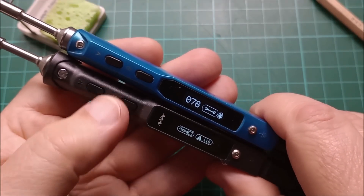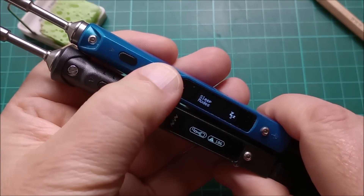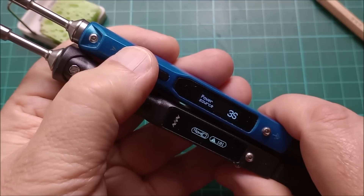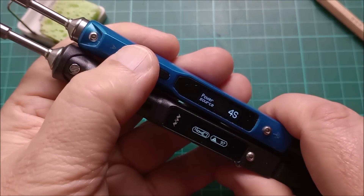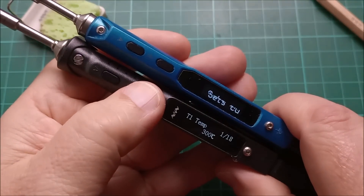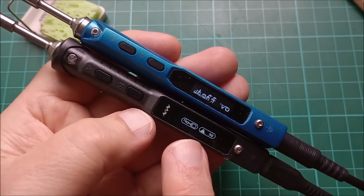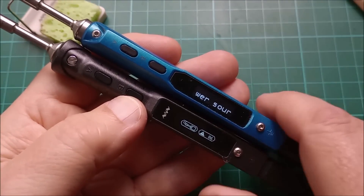Menu structure: on the TS100 you press the back button to go into the various menu elements and then press the front button to change an element. For example, to change the power source you can select 6S, DC, 3S — the number of cells of a typical LiPo — and I set this to 5S because that's what my power tool battery is. On the TS101 you press the back button and you have 18 pages of settable menu items. This one also drops out of the menu structure after a few seconds, whereas the TS100 locks into it and you forget how to get out.